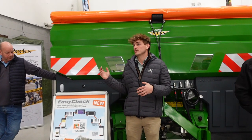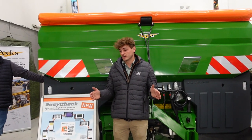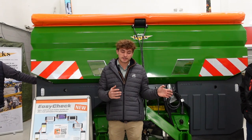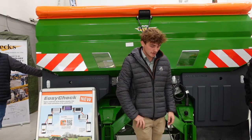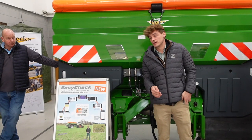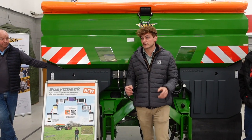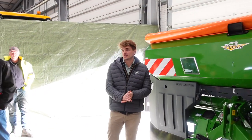If you haven't got wind control on the machine, you go out into your field, put your mats down, do a pass either way. If it's a bit windier you'll need to alter the settings from what was sent from Germany. You place your mats down, then go along with your phone to take a photo of each mat, and it tells you what settings to change to counterbalance any discrepancies — because you can get variations with fertilizer weights and grain. So that covers the ZATS. Moving on to the ZAV.